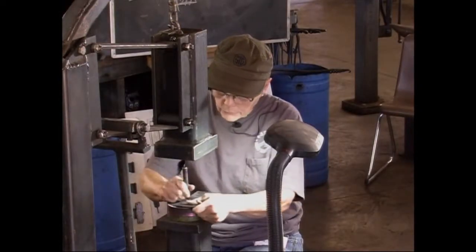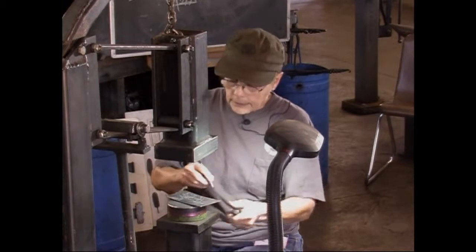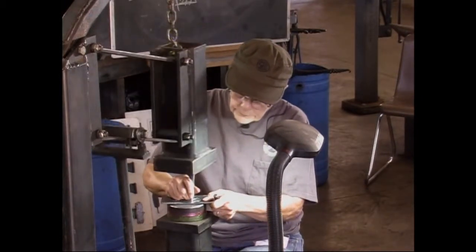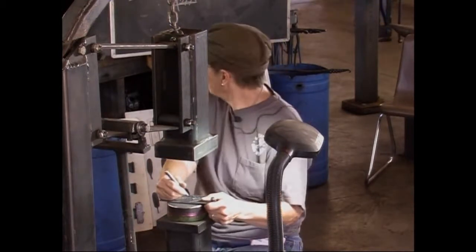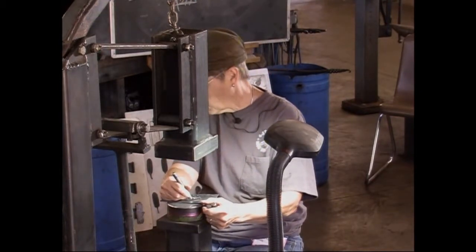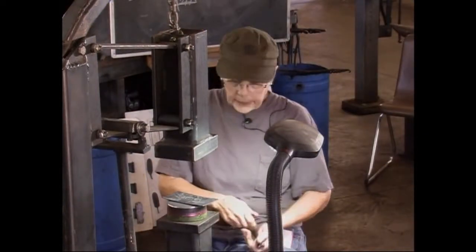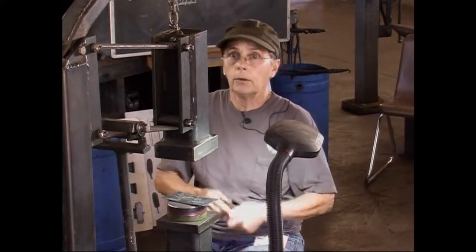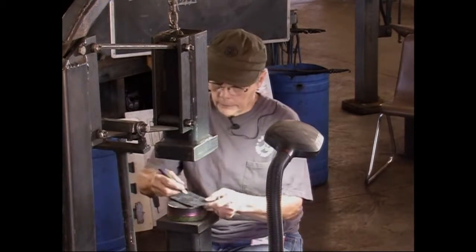Somebody asked earlier about other ways of removing the scale, like pickling it using vinegar. Yes, I do use vinegar on some pieces. There's a fish hook that I did. Do you know where it is, Mark? It might be in the van. I pickle those in vinegar and then paint them. But anything like the feather or things that I have undercut, I don't use a pickle because I'm afraid it might rust under there or in those hollow parts. Anything that's totally flat, like the fish, I'll pickle it. It's not a big deal. And then, you know, neutralize it.